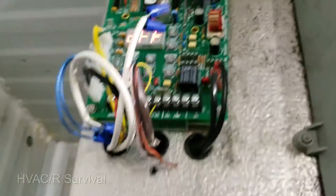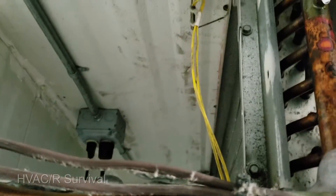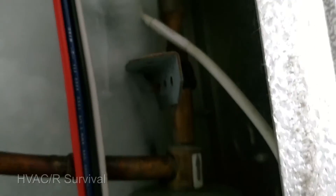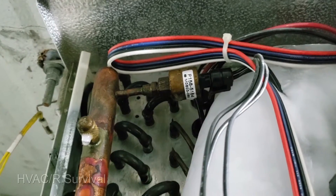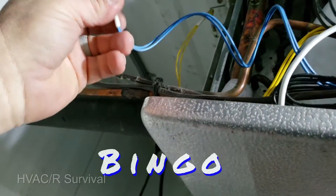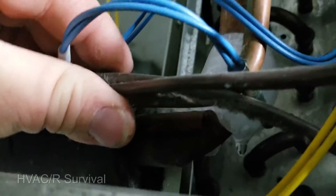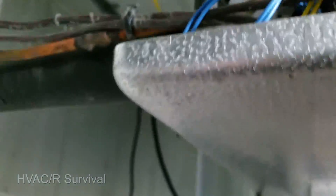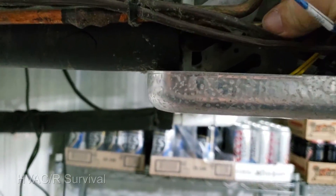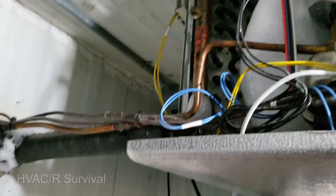Going back over to check this unit — it has its own temperature sensor right there. This one also has its own sensor, and there's your electronic expansion valve, your suction pressure transducer, and a temperature sensor. I noticed it would be better if that sensor was actually attached. I wonder if it came out — that's where it belongs. I didn't pull hard on it at all, and look at that, it won't fit back in. Basically, right there is our issue: the sensor for the suction line is not attached.